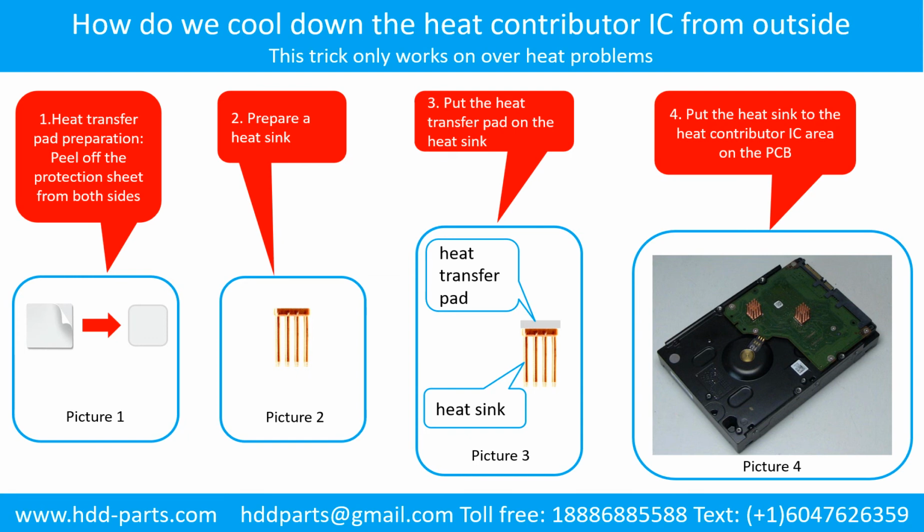Step 1. Heat transfer pad preparation. Peel off the protection sheet from both sides of the heat transfer pad, like the picture 1 shows. Step 2. Prepare a heat sink, like the picture 2 shows. Step 3. Put the heat transfer pad onto the heat sink, like the picture 3 shows. Step 4. Put the heat sink to the heat contributor IC area on the PCB, like the picture 4 shows.